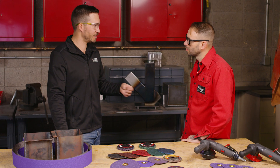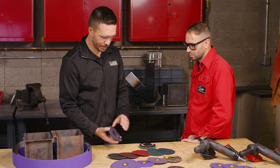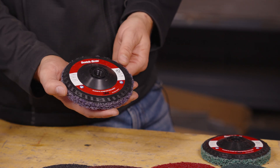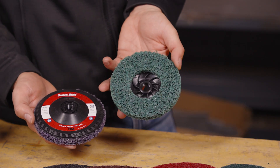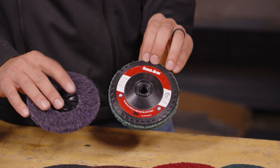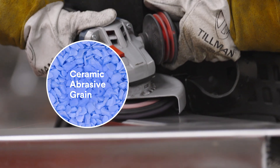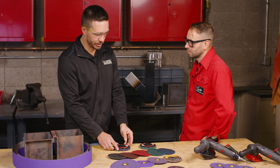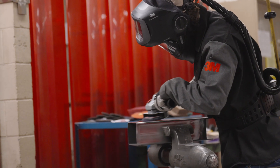If it's a really thin substrate, thin mill scale, or even medium mill scale, the Clean & Strip product is fantastic — especially our XT Pro, the silicon carbide version. The mineral in this product does a great job of fracturing and continuing to cut, whereas our Extra Cut product, which sounds like it might cut more and do better, actually tends to dull out and not work as well on mill scale. It does great on paint and rust and other things, but with mill scale the silicon carbide mineral actually performs better. This product is fantastic — it works super quickly and it's great to get down to that base metal and get back to welding.